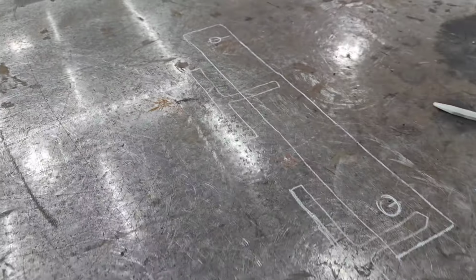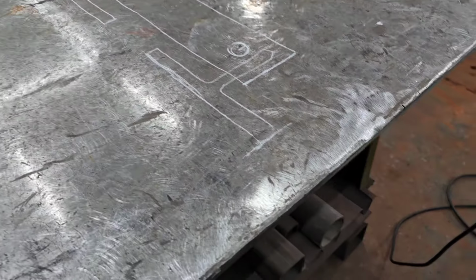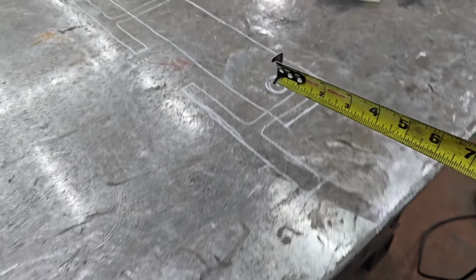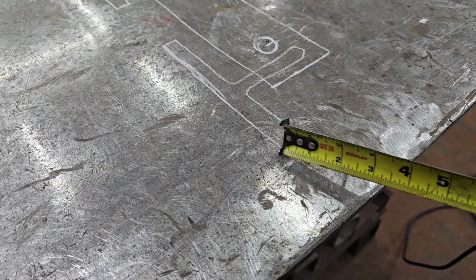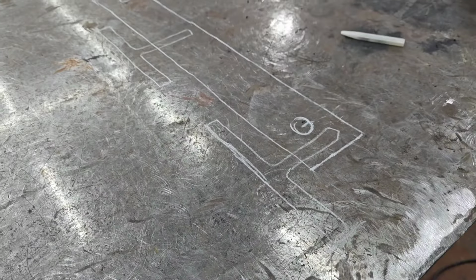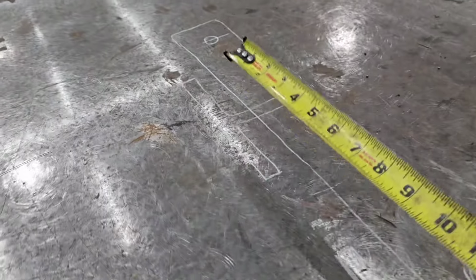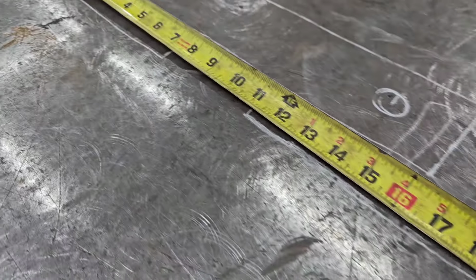So the next thing I did, knowing those dimensions, is I just kind of did me a crude little drawing right here on the table. And the way I did this, I'm figuring, all right, the edge of that table is the floor, and 2.5 inches from the floor, I want that thing. This is where the bottom part, where we measured the 2.5 inches of that fork, is going to latch onto the bottom of that beam. And then we know, from measuring the fork from there to where we want to latch on the top, that's where we want the 20 inches.